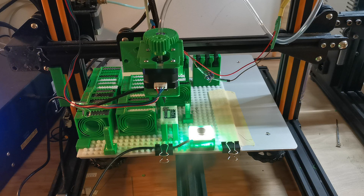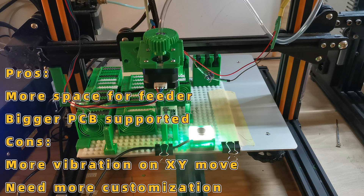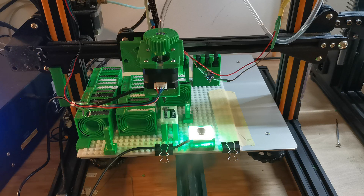As a summary: the CR10 comes with a bigger build plate, meaning more components or bigger boards can be supported. On the other hand, it also comes with bigger X and Y movement vibration, which can cause feeder components to bounce off or the component in the nozzle tip to shift or drop. You need to customize the X and Y movement speed to ensure smooth PCB placement. These are the pros and cons of using the CR10 — overall it can still do the job, but you need to carefully customize it. If you have any questions, feel free to leave a comment. If you liked the video, please like and subscribe. See you next time!